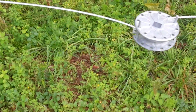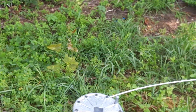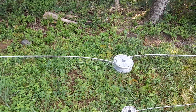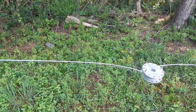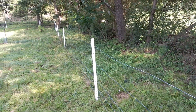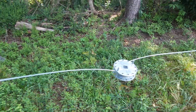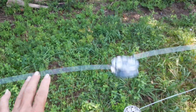Just to give you a little update and context: remember when we tapped this top wire, it just oscillated very big. Now I tightened it, but I didn't tighten it completely, because I've got three different daisy wheels around the perimeter of this fence. This is the daisy wheel for this long run here, and it's the wheel closest to the damage. I'm also going to want to tighten it around the rest of the perimeter, so the top two wires are still not 100%. But if I tap that, see how it bounces a lot faster than it did before? Before it was going slow — now it's bouncing a lot faster.